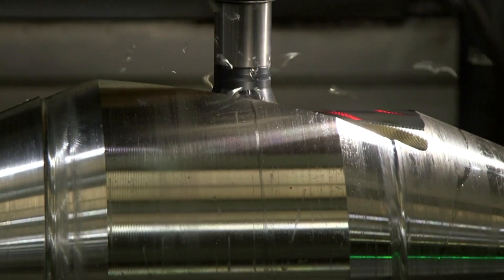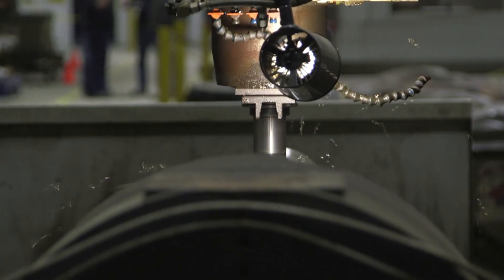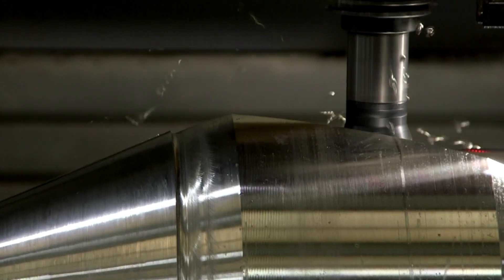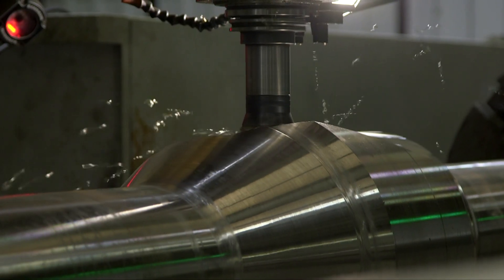The blades will be machined for about 14 hours while the cutter heads slice a 32nd of an inch of material each pass, using three-inch cutters with seven carbide inserts. The carbide inserts are replaced on a regular basis, which means this stabilizer will go through about 120 inserts before it's done with this step.